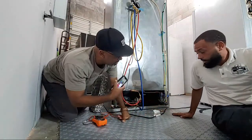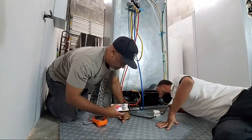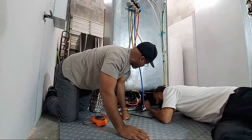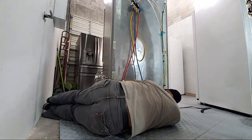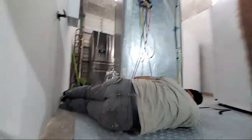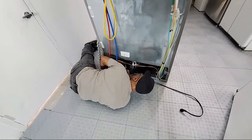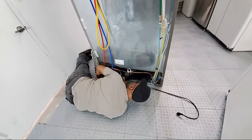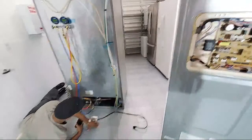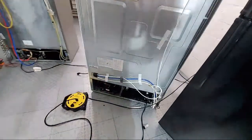That's a DC though, right? I don't think so. You don't think so, bro? Let me see your light. The reason why I don't think so... Oh no, it's not. Look at it, you can see it. Okay, it's not. Look at your wire sizes. That's always a little trick. Oh yeah, a little larger. But what does it say? 115. What are the words after that? Does it say VAC? No, I just said 115 volts. Well, you know that if they're talking 115, it's AC. Look at the wire sizes too. Yeah, it's larger. And now look at your wire sizes on this DC.